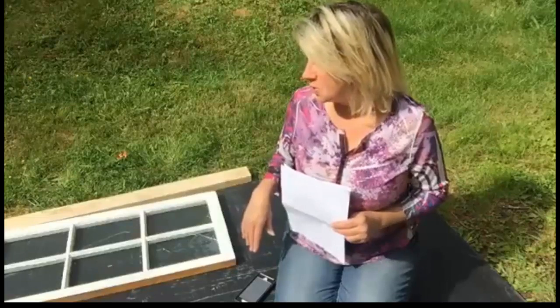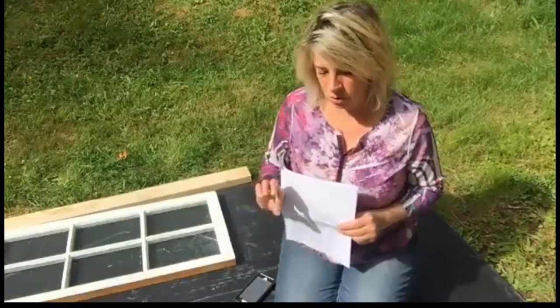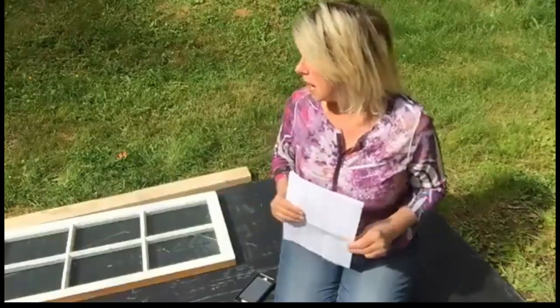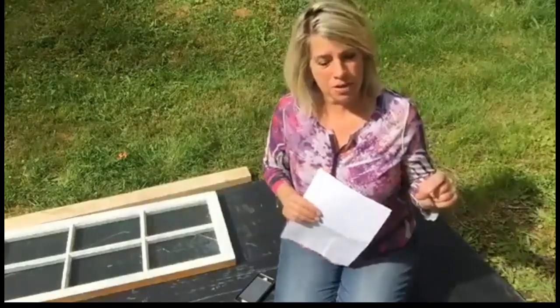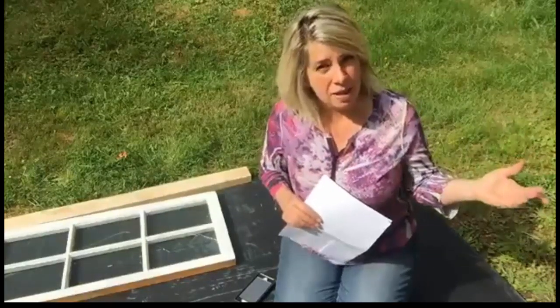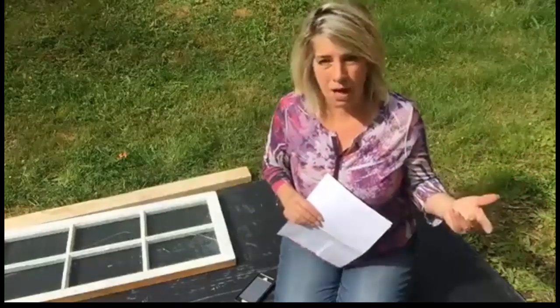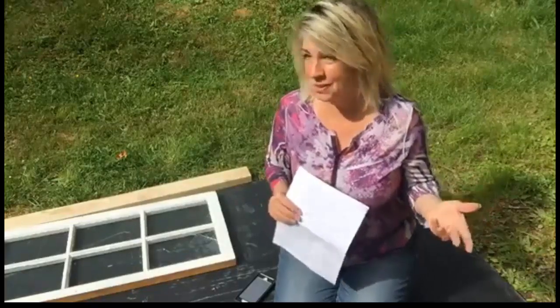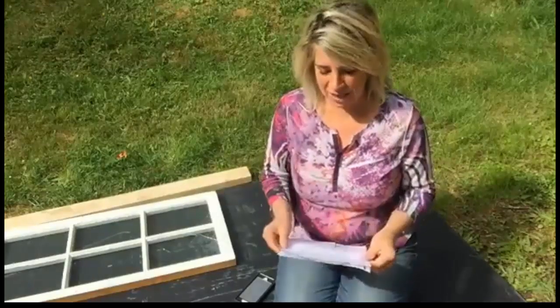So you want to take that into account, because most of us didn't know when we started building that a four inch post is actually a 3.5-inch post. Just like the countertop that Terry's going to be using, the wood is a 2x6, but it's not a 2x6. It's 1.5 inch by 5.5 inch. They always seem to want things to be bigger than what they actually are. I don't know what that's about. I think it was a man thing again.